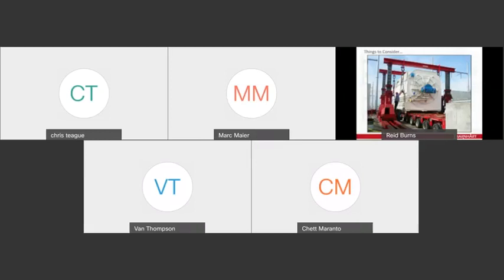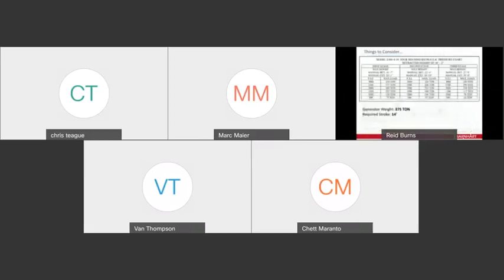Well, hold on. Let's take a look at the load chart for those gantries and see if they're really the right equipment for the job. As you can see from the chart, the legs do in fact have a 450-ton capacity, but only in the first stage. So your first stage takes you from a retracted height of 10'2" all the way up to 23'1", and that's assuming that you extend and pin the dead section. But that's only 12'11" worth of stroke, and we needed 14 feet. So it's not enough stroke, which means you're going to have to go into the second stage of this unit.